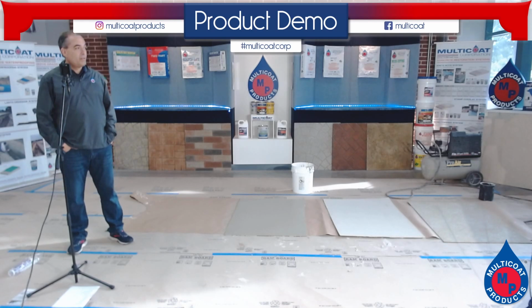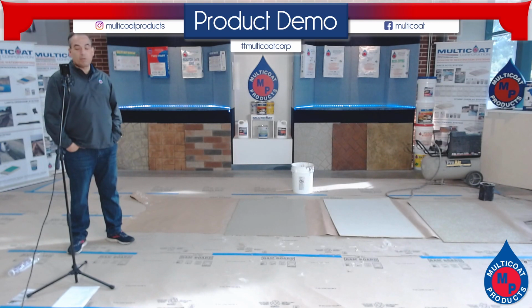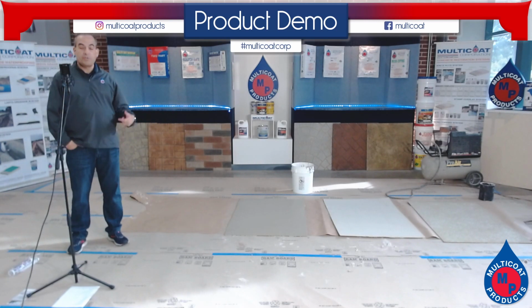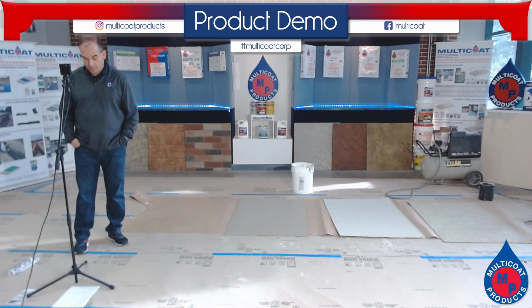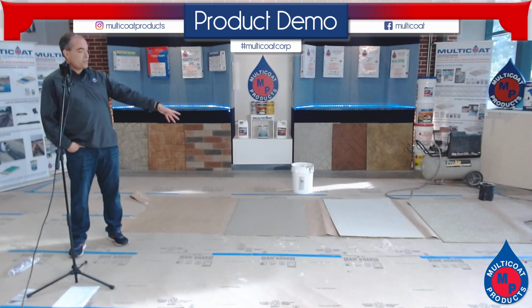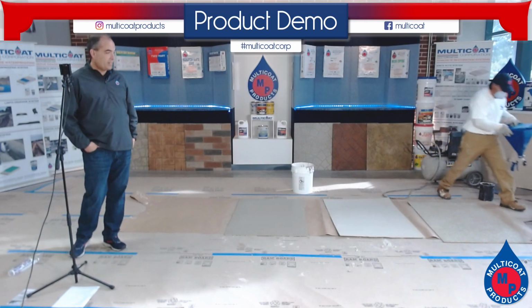It gives you better coverage. It's a more heavy-duty hopper, and it's fairly easy to clean and easy to work with. You could spray not only scratch coat, you could spray our Creek Coat, you could do stucco with it. It's a great all-around product. So the steps we're going to do is next he's going to shoot texture, and then on the next one we have some texture he's going to color with our Color Seal.